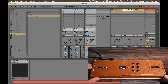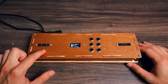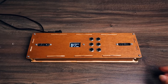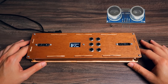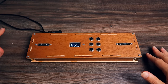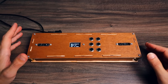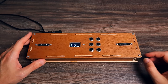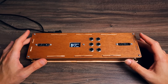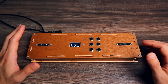The next big difference is in the type of sensor. The original theremin uses capacitive sensors, and this one uses infrared distance sensors. I tested different types of sensors like ultrasonic sensors, but ultrasonic sensors work fine for big hard surfaces — I don't think they work really well for the hand. For me, the infrared Sharp distance sensors were the best. Those sensors are a little tricky because they have a lot of noise, but I found ways in the code and in the circuit to overcome this and have a more stable reading.